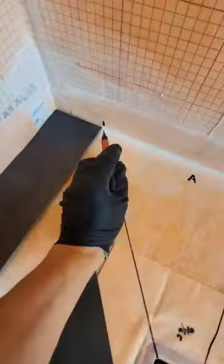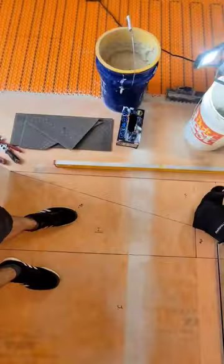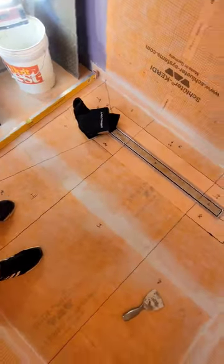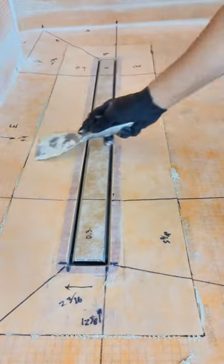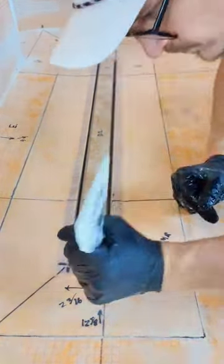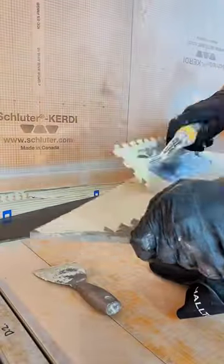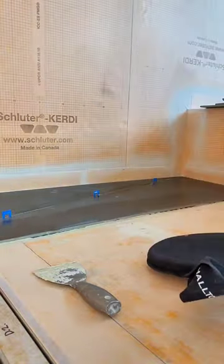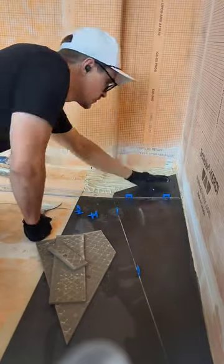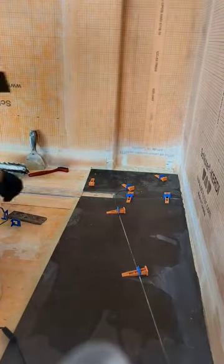Here's a method that's becoming more popular for tiling shower floors with large format tile — it's called an envelope pan. Essentially, you draw a straight line from the four corners of your drain, whether it's a standard square drain or a linear drain like you see here, tracing it to the four corners of the shower perimeter. Then you cut all that out — you either template it or draw it onto your tile however you want to do it — you cut it out and ease the edges.